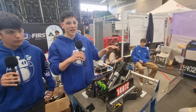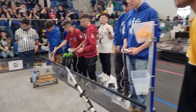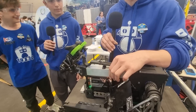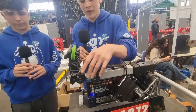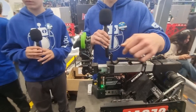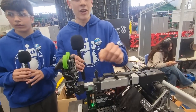Our main design is based on a moving elevator on an arm. We have our telescope here — it is our own custom telescope made out of 35mm tubes, 25mm, 25mm, and 15mm. On each tube there is a different bearing that makes the slide really smooth and stable.